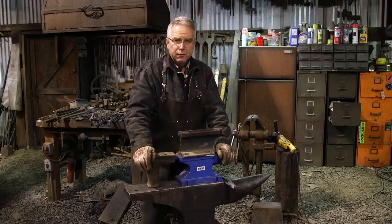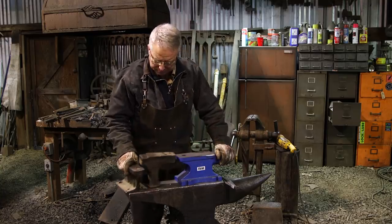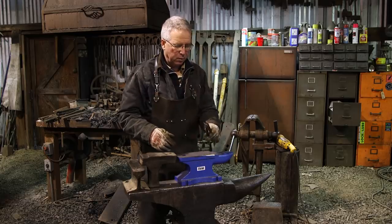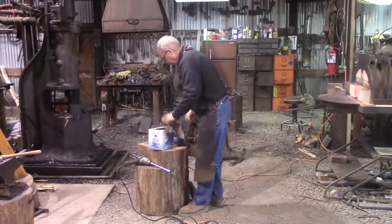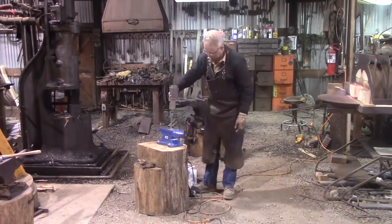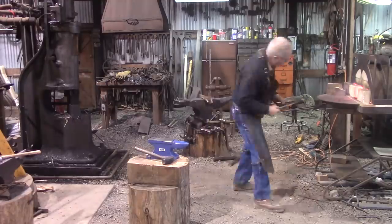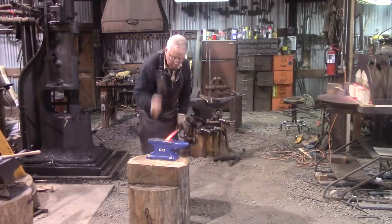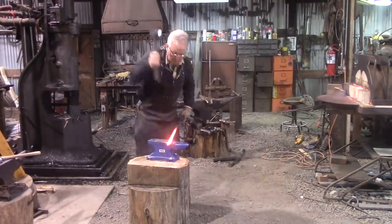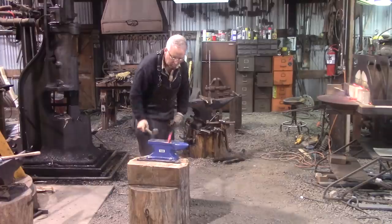So how do you come to some sort of conclusion about a Harbor Freight anvil? I made a set of tongs on this anvil and they work, but it was hard. I was tired, and I can hammer and work. I had a new blister at the end, and I didn't feel like smithing for an hour, because it has no rebound — so it is all work. If you use a heavy hammer you're giving up a lot of energy; if you use a light hammer you don't have much energy to start with.